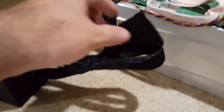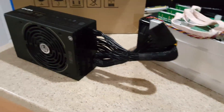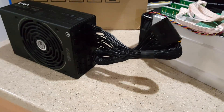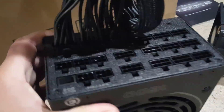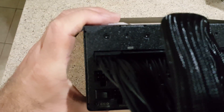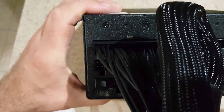We've plugged our little cap on the end now. What this allows the power supply to do is run without a motherboard — basically you can just use it to power any device, i.e., the Antminer S9. That plugs in right here. They are actually labeled, and it's the MB slot right there. Plug those in.